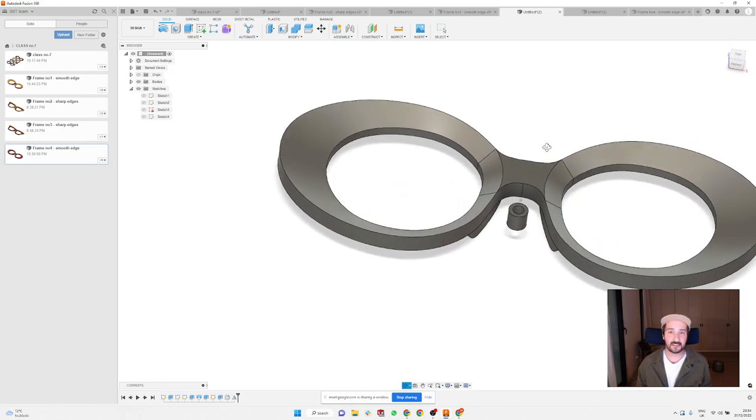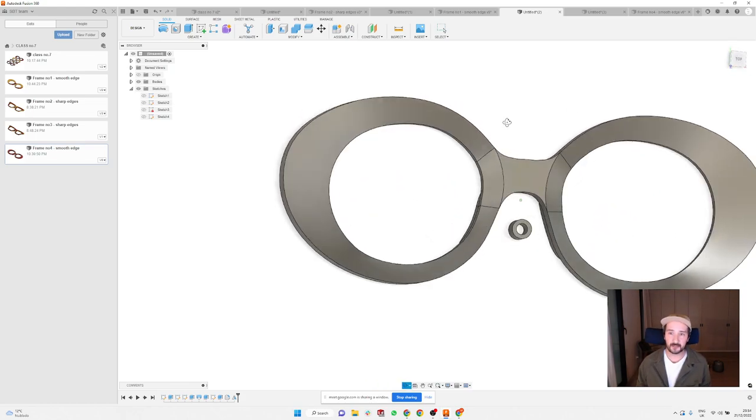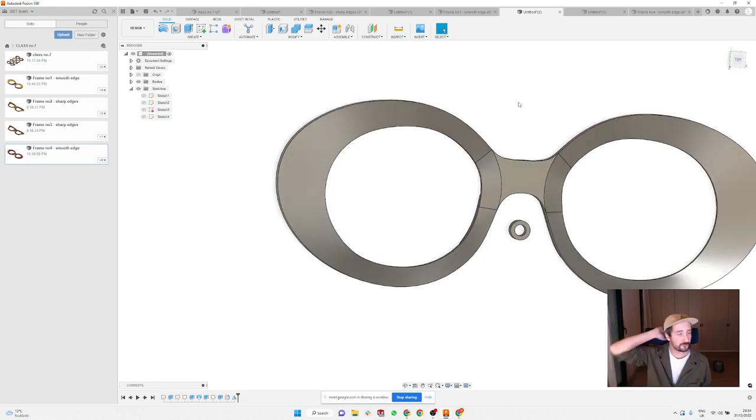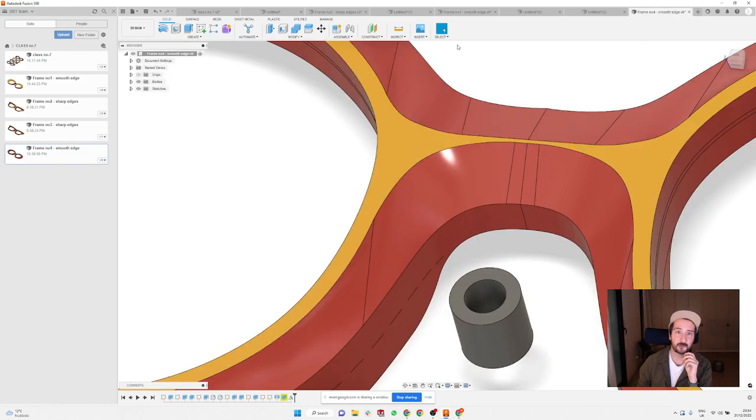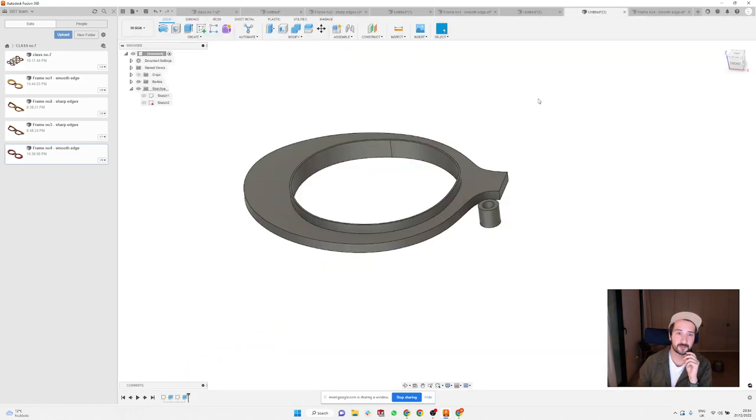But yeah, I think it's definitely worth a try, and it can make really interesting frames. It's a bit of advanced knowledge to do these surfaces, but it can make some frames way more interesting. Yeah, I thought you needed a 5-axis to do something like this, but this is way cool. No, literally the operation that I'm always using is scallop, and it's absolutely spotless. It works really well.